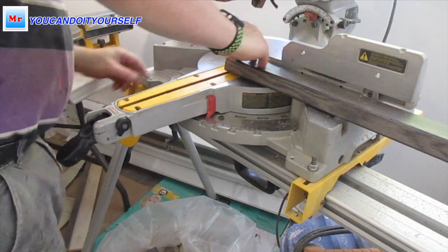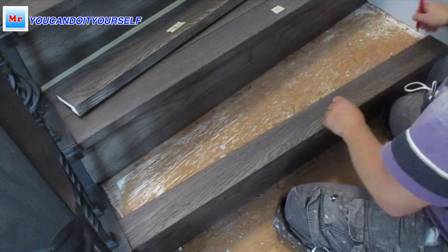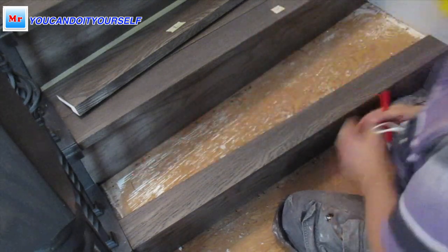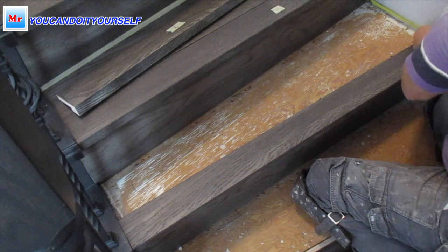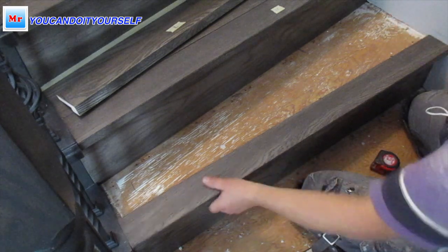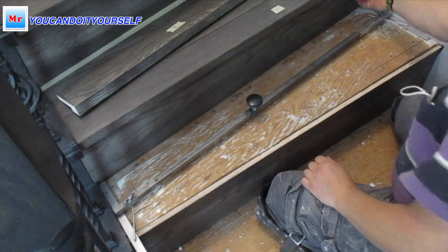If you have 1/16 from both sides when you start settling the nosing, you will see the imperfections and you can mark with pencil and then pre-cut it perfectly. When I put the nosing in now I can see the exact dimensions for the tread from the left and right side. I make marks one more time and then I measure — from this side it's five inches, and from the right side it's ten and five-eighths. Now we know the dimensions from both sides, then I use the stair jig to measure and set the angles I have to pre-cut.